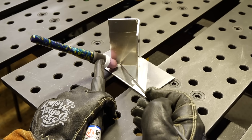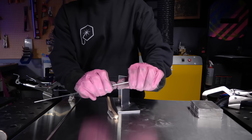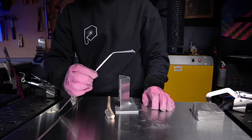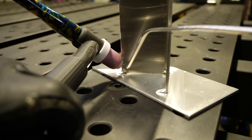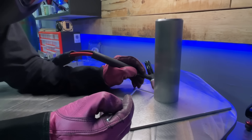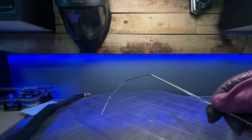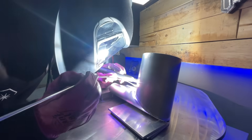There is a major problem people run into when welding towards a corner: how are you going to feed your filler material properly? Angles change so fast that you're basically fumbling to keep up with the filler material correctly. Here's what you do — bend the filler material. You can just guess how much you're going to need and make a little bend so you can keep your filler material hand out of the way to see clearly. This gives you a little cheat to help work into a corner. It works great welding around pipe too. You can do one bend, two bends, three bends — whatever helps you keep your hand out of your face.